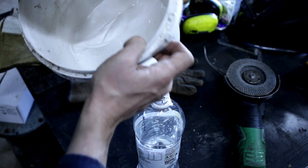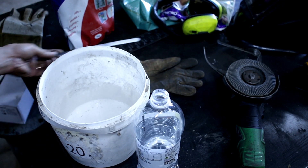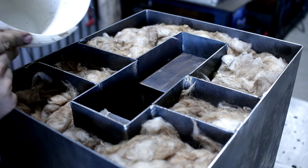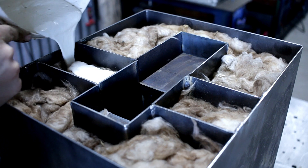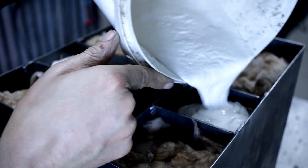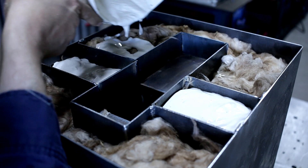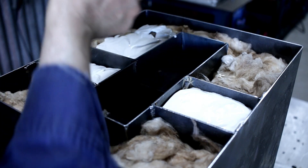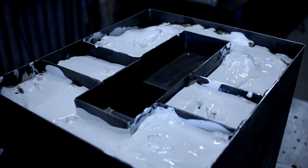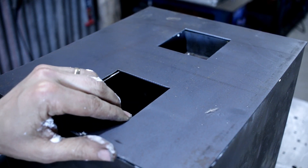The mixture's a bit wet, but that's okay because that insulation — that rock wool — is just going to pull the moisture out of it real quick. I just want to seal the top, just enough to seal it, put a cap on it. I'm hoping that the fibres, the insulation fibres, will sort of bond with that a bit and sort of reinforce the plaster.